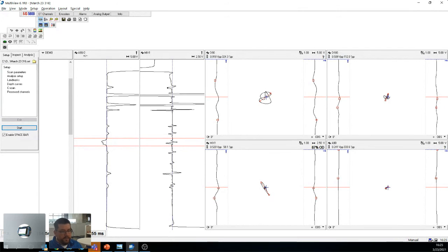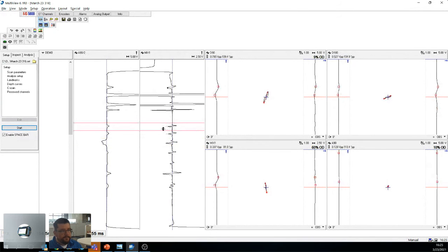And the right probe is just dependent on the material and the wall thickness. So the resistivity and the wall thickness. So as long as I can find a probe that my F90 fits in that range, then it doesn't matter what I'm looking at. This is what I'm getting as far as a result. Okay.